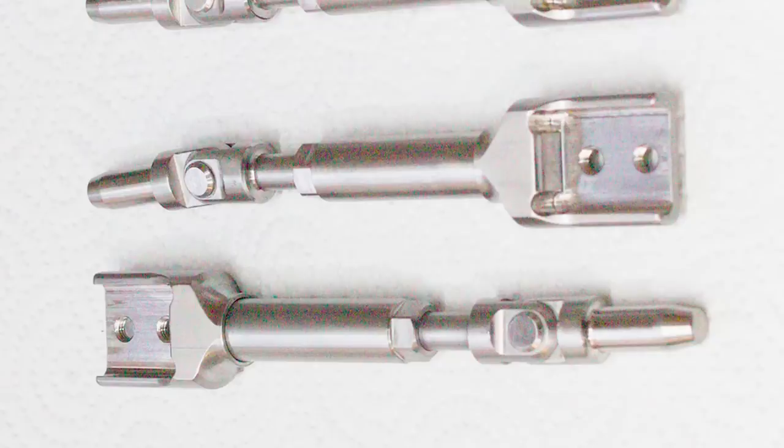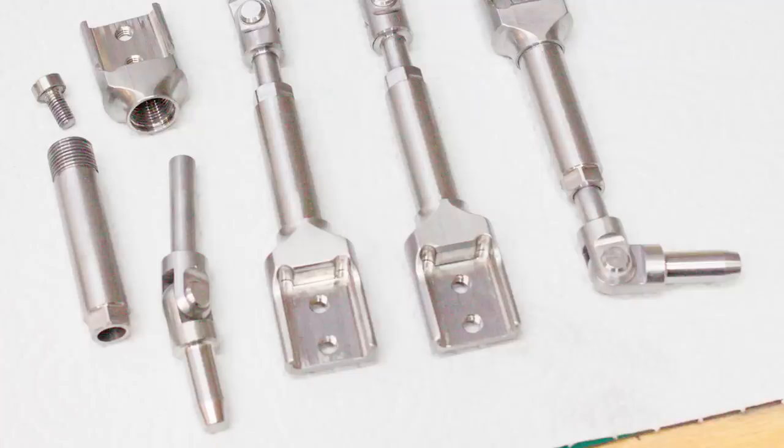Again, I didn't film this. A lot of Scotch-Brite and Cratex wheel work on the stainless parts to get all edges and corners chamfered and rounded over, final cleaning in the ultrasonic cleaner. Some never seize on the threads, so it doesn't seize up when I finally get it assembled. And I also made a screw from stainless steel that you can see in the left upper corner in this picture. Each of these assemblies needs one screw. So these are the flux capacitor springs.